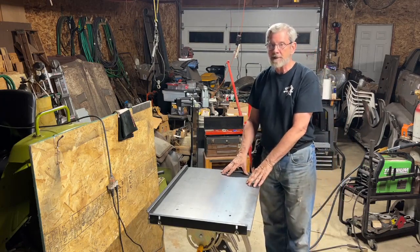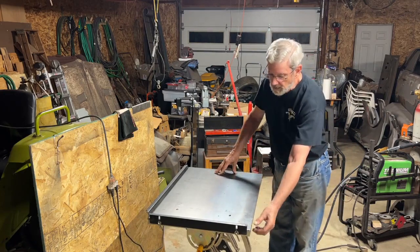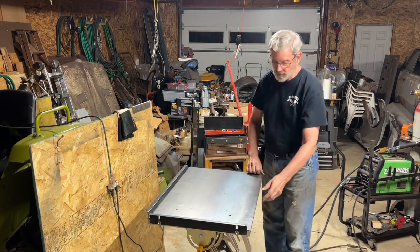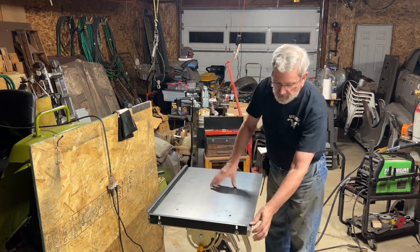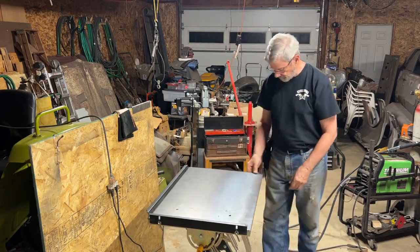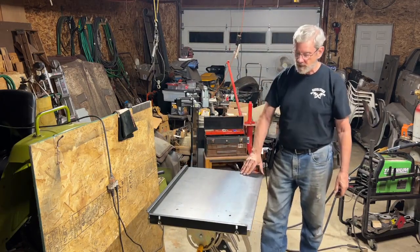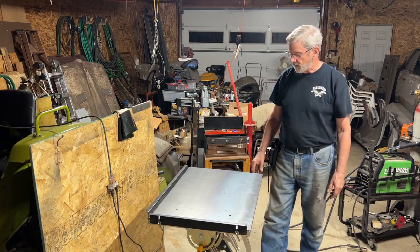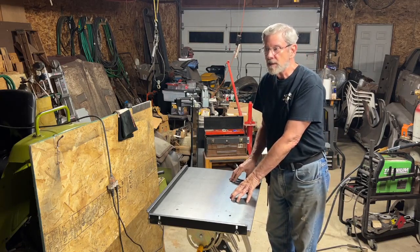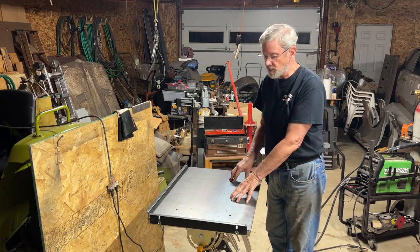On this side I may have to take the mill scale off — I'm not sure about getting a good ground through it. I did round the edges slightly so they weren't quite as sharp, and rounded the corners. This one I couldn't round as much because it was so close to the table underneath, but the others I put about a 3/8-inch radius on them, just to protect myself from sharp corners. That should keep me from dropping things through the slots — I've never actually used the slots for clamping.